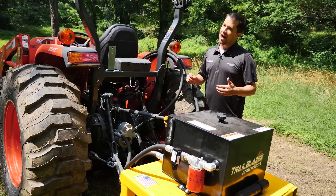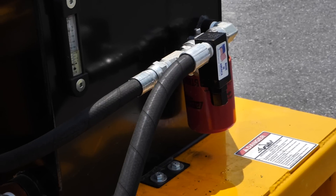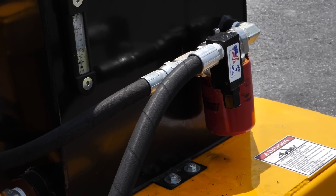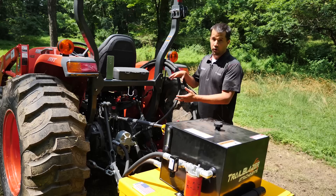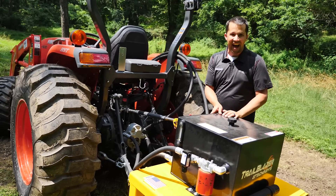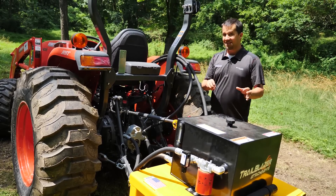The Power Pack also addresses the concerns of feeding this thing and properly returning the oil to sump, as it becomes a self-contained unit. With two hoses that run straight up to the mower, you can plug the thing onto your tractor and go with no worries about how you're going to get it hooked up. It also provides two added benefits: ballast — it weighs several hundred pounds to help offset that mower — and it helps with your cooling. Most tractors usually have six or eight gallons of hydraulic fluid in the rear end, and you're generating a lot of heat driving back into your tractor where there is no active cooling. With this Power Pack, you've got 17 gallons of hydraulic fluid inside a big metal box that can radiate that heat off and separates any of those concerns from your machine.